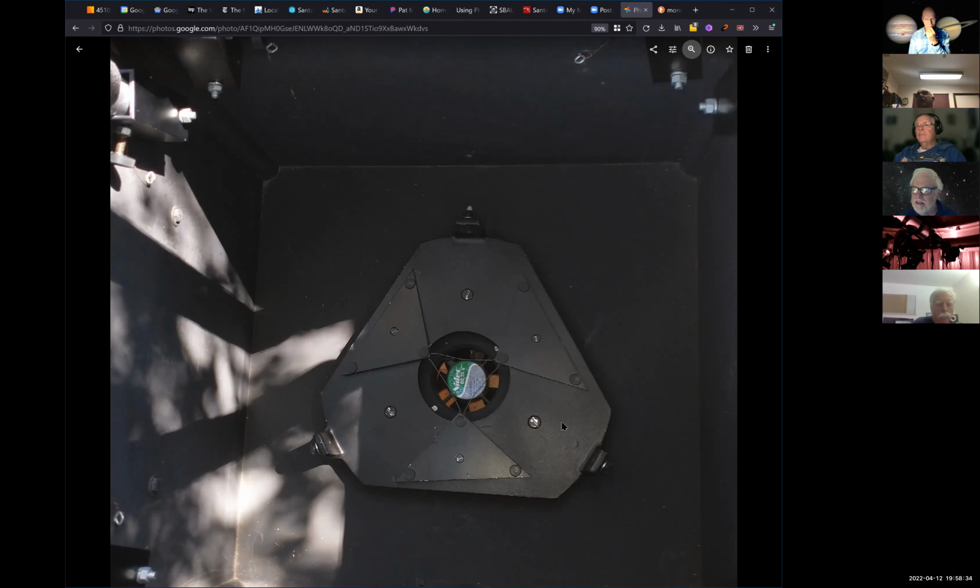Huh. I wonder if that would work. Well, what you need to do is get a little freedom in that board at the back, and then set these screws so they're all about equal tension. Then you need to start tipping the board with shims until that gets the spot in the center of the mirror, and that aligns the mirror. Okay,